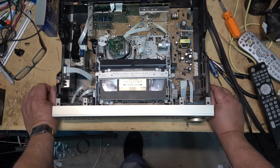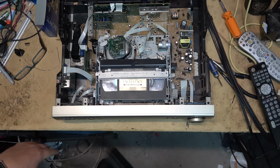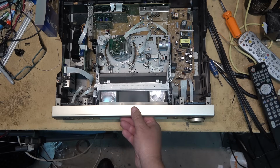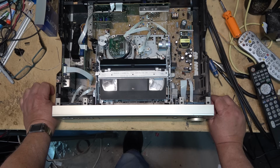Like that, but louder. There, you can hear it. Hear the tape squeaking? This tape is starting to suffer sticky shed. And of course, when it does that, the tracking goes off. That's interesting. I never noticed that last time I played this tape. Put it on this one here. The tracking tracks up perfect on this one, or close to it.